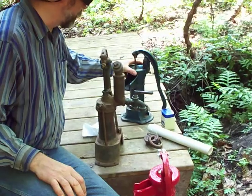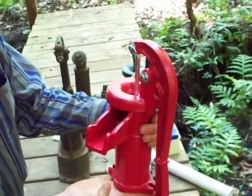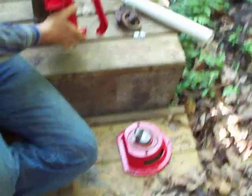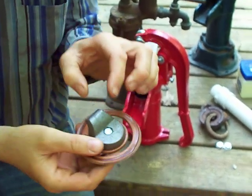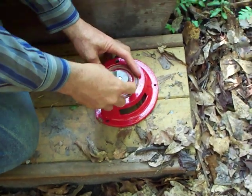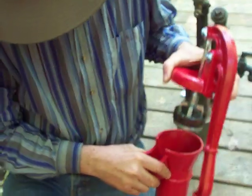Now, this is a pump I've been having for years, and when it went bad I could have changed the leathers. I'll show you what the leathers are if I pull this apart. You've got two leathers in a pump. The first one is your valve leather. Now, if you go on eBay and you see a pump that looks just like this and it says antique pump for sale, you're not buying a pump — you're buying the top half of the housing, because without this base you don't have a pump. The outer part of this actually acts as a gasket between the base and the pump body. The center part acts as a seal for this here, which is called a check valve, and this little piece is actually acting as a hinge. When you crank that pump, it'll suck water up, which causes this to open, and when you get all the way up and go to crank down, that shuts so the water can't go back down in the pump. These things are not as complicated as you might think. This is what I call appropriate technology.